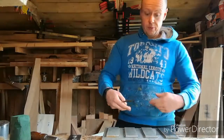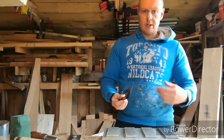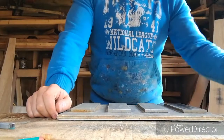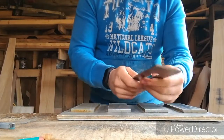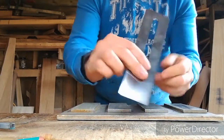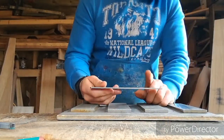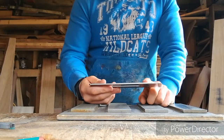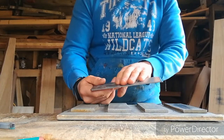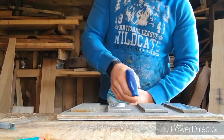So I'm going to go through sharpening my plane iron. I'm going to get that camera set up a bit closer so you can see what I'm doing. I'm going to sharpen my number four plane iron. This is a Hock plane — the steel is harder so it takes a little bit more sharpening. I would recommend you get one of these or something equivalent. I'm just going to spray some window cleaner on the stone.